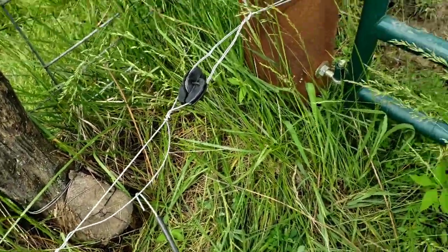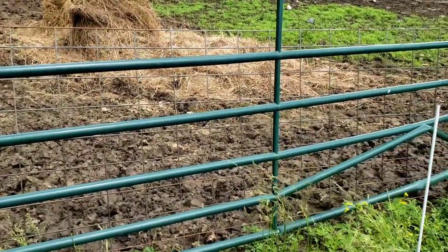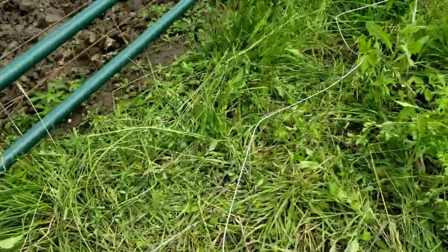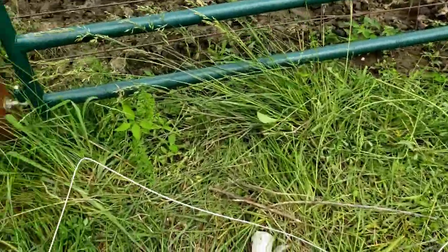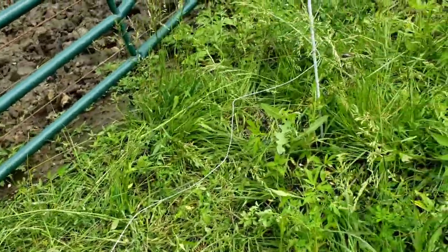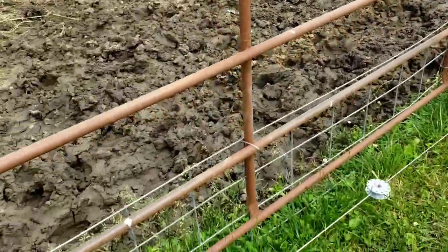We've made a kind of makeshift gate here. We only use this because this gate doesn't really get used much — maybe in an emergency or something. We took a piece of high tensile fence wire, kinked it to put some spring tension in it, put a piece of insul tube on it for a handle, and then just hooked it in. All it's really doing is carrying the electricity across that area over to this stretch of fence here.